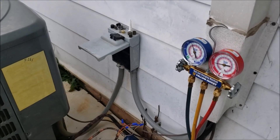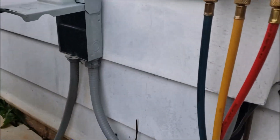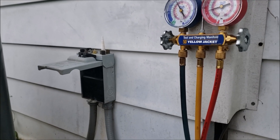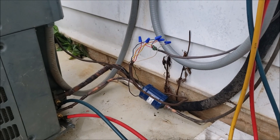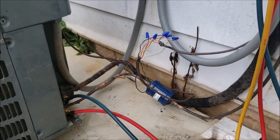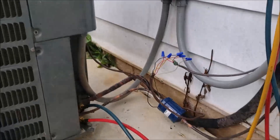I just got done adding some more Freon to it. Had to add about five pounds to the line set and the air handler. I went inside and checked - we got a 20-degree split from the air going in versus what's coming out the vent. So it's performing really well. I won't post this video for another week or two - I'm going to let it run and make sure it stays steady and does its job, so I can give a good report and make sure this mismatched system is actually going to work and perform.